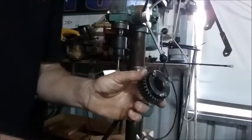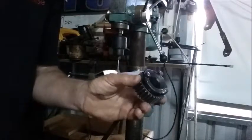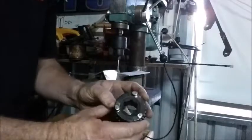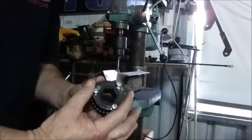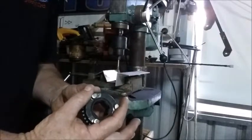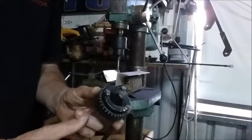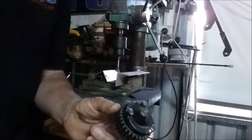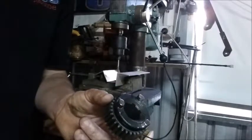And then we have a back cut gear that has exact same cuts on all three faces. If they're exactly the same size here, all three faces will meet at the exact same time in the female side of the gear, and that will be a precise setting. So we'll just go through and finish that, and then I'll do the female on the other gear and we'll have a look at it.